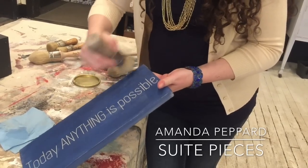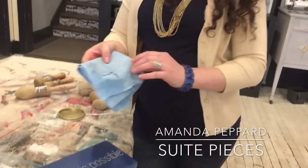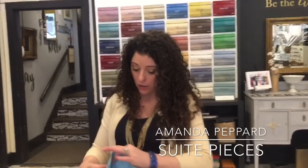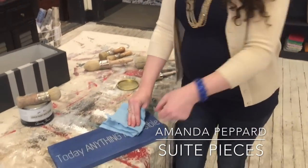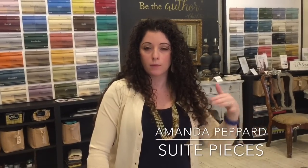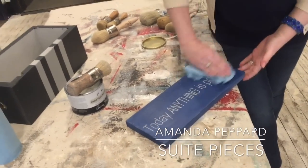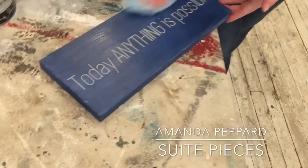You're going to give it time to cure. Did you know that traditional latex paints and top coats take time to cure too — about 30 days or so? If you've ever painted a piece of furniture with latex and pushed your fingernail in, it will get indented because the latex is curing. So most any product is going to take time to cure. Drying and curing are two different things. Your wax is going to be dry within 24 hours, and it's going to cure — each day that passes, it's going to continue to harden for the next five to 21 days, maybe a little bit longer if you've put on a lot of layers. The more wax on there, the longer it's going to take to cure. What's happening over that time is the wax is really bonding with the paint and the surface, getting nice and hard and durable.